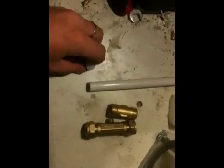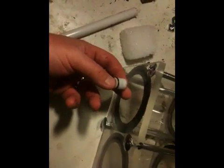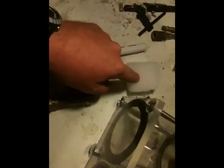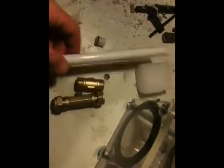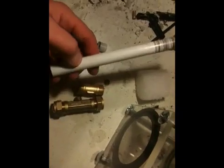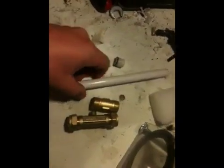As the bubbles come out through the one-way check valve underneath here from the actual primary bubbler, it's going to not only clean the water and the bubbles, it's also going to make the bubbles really tiny as well. So there's less chance of a flashback actually happening in the unit at all.